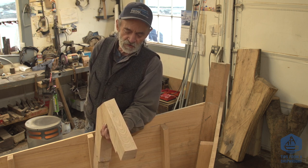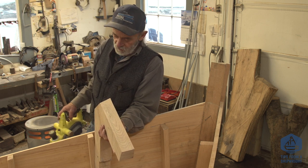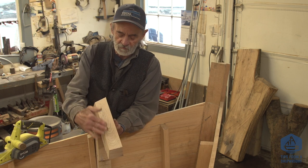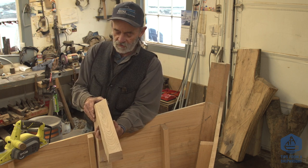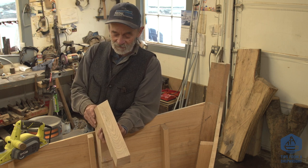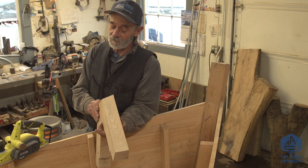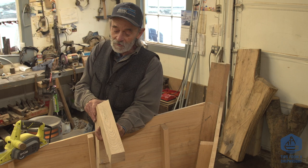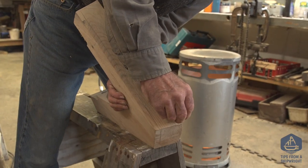And it's a nice straight fit. One of the things about a skiff is that all these pieces are straight fits. They're not curved, or it doesn't have a progressive bevel to it or anything like that. It's a straight fit. Basically, what you're trying to do is get that straight line to be at the right angle, and the thing's going to fit. The same thing on the other side, and the same thing up forward. So there's still some technique involved to handle this electric planer and make that happen, because this is kind of joinery work almost with an electric planer. So I'm going to take it over to the horse now and get started.